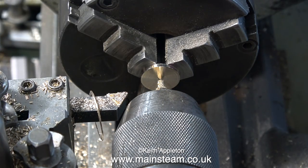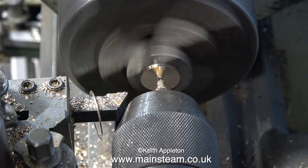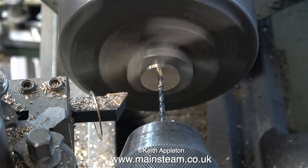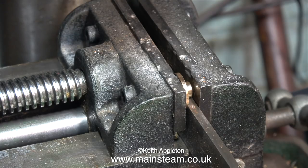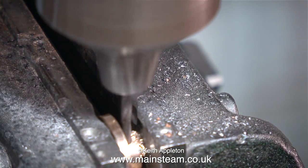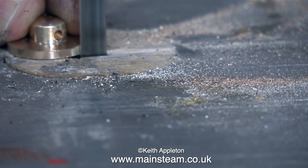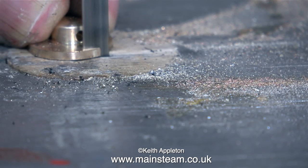Once parted off, the next job is to reverse the piece in the chuck and drill from the other side — first of all with the centre drill, and now I'm using a twist drill of 1/8 of an inch in diameter. So that's the hole down the centre made; now I need to drill a hole from the side to silver solder a copper pipe into. I'm really sorry that the part's out of focus, but the end of the machine vise is quite well focused. This next part of the job is extremely dangerous, but my fingers are not quite as close to the blade as they look on the video.